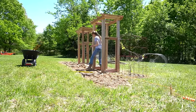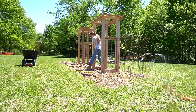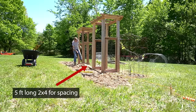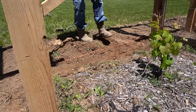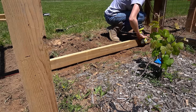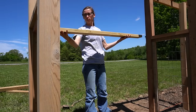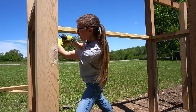To keep things straight, I used a couple of stakes in the ground and pulled a string between them to help line up the arbors. I cut a piece of 2x4 to 5 foot long and used it to space these arbors 5 foot apart. Then I pulled the posts so they were just touching the string. I drilled pocket holes into the ends of this 2x4 and secured it between the arbors at the bottom using exterior pocket hole screws. Then I did the same with another 2x4 about halfway up the posts.